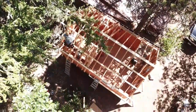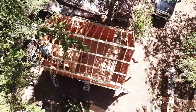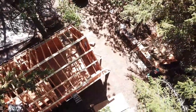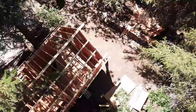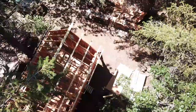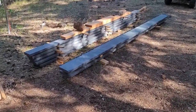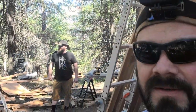Getting this roof system the way I wanted it just took way more time than we thought. It took a day and a half of grinding pretty hard — there's just a lot to it. We put every bird block in, perfectly spaced our 1x4s up to the peak, and then built out our eaves and our barge rafters, which are on the gable ends, giving us an 18-inch overhang of sheet metal. There are those trim pieces, all painted up to match the sheet metal for the roof.